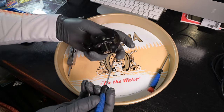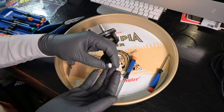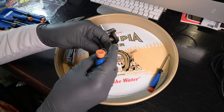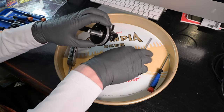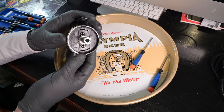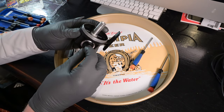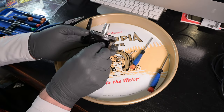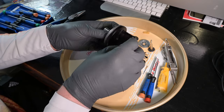Then what we have is a reversing clutch — here comes the reversing clutch, and there's a little keyed sleeve inside it. The sleeve pops out of the clutch just like that. Now we pretty much have it stripped down to the body. In terms of annual servicing and repair, it's about as far as you need to go. A little brass color piece can pop out too if you want to move that.